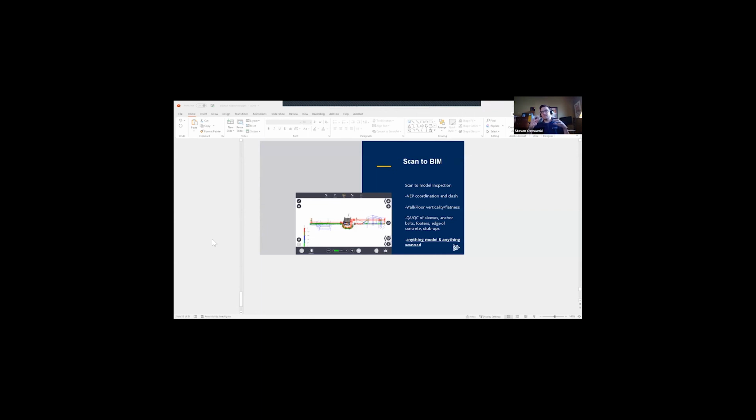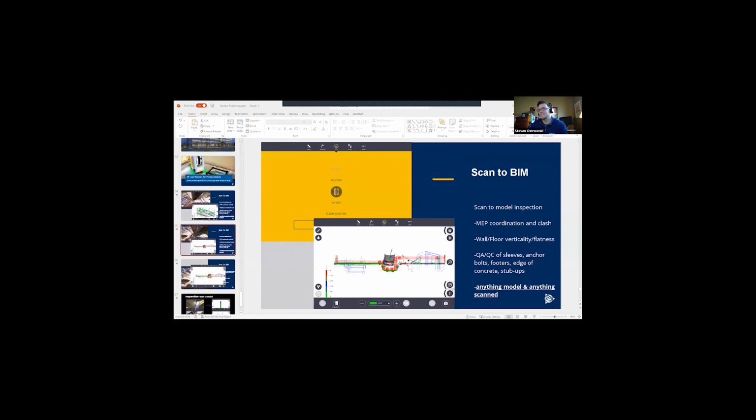If we can click through, we may just have to give up. Another example here showing it with a fire sprinkler in a busy underground mechanical room from an add-on to Harvard. They're putting on a new connecting building, and they're putting in a new mechanical room where, again, it seems like I'm picking on them, but the fire sprinkler was installed in the wrong location, and that's shown in the scan data here, and this would be the model of it being off about 4 inches. Also in there is a scale bar showing you where the scan to model is differing. But you can do the same thing with elevator cores like you see in the top here, where you can show the lean, or even larger mechanical pipes like we did at BCU here.